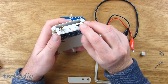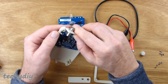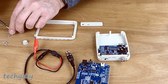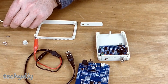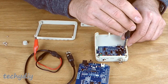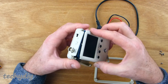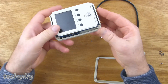The BNC connector and switch were inserted through the holes in the small top panel. The analog board was fitted to the back panel and screwed down. Then I fitted the small bottom panel to the front module. The front and back were combined with the test terminal inserted into the slot, the pin header located into the socket, and the small back panel located into the back cover.